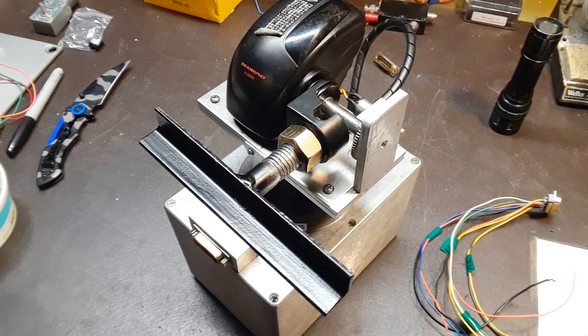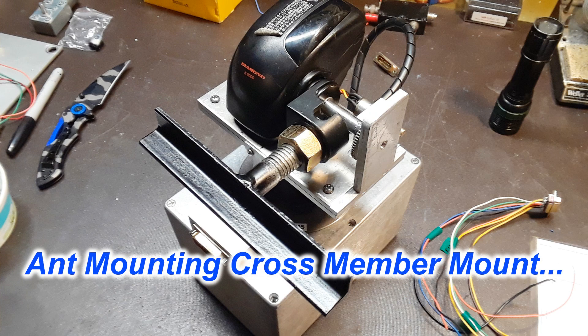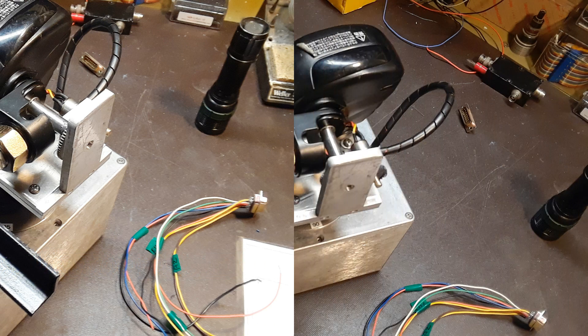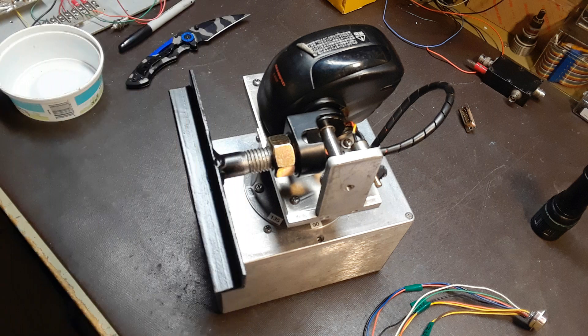One of the other main things is having to mount the antennas to this thing. I built up a little piece of angle iron welded to a bolt that simply threads into the hole in the elevation motor. Since the idea is to have two antennas — probably a VHF and UHF vertical antenna or small Yagi — a cross boom will simply hose clamp to this angle iron with the antennas on each end.